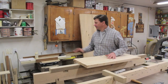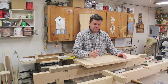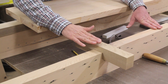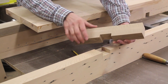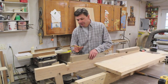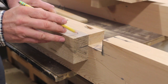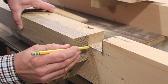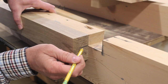I've unclamped the top and the bottom and now I'm starting to work on the oak cross pieces that will hold the bottom shelf of the altar and also support the top. I decided I wanted the shelf at the bottom to float over the beam about an inch, so I cut a shallow notch in the shelf support. The oak supports that will hold the top I want flush with the top of the beam. I'm holding the white oak top support flush with the top of the beam and marking the line at the bottom of the notch — the distance between that line and the bottom of the support is the depth needed for the notch.